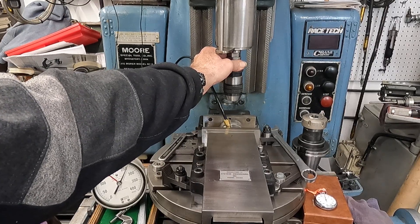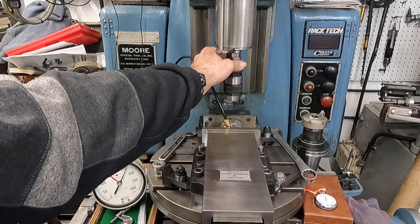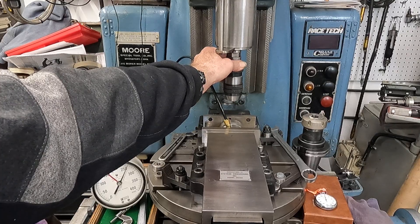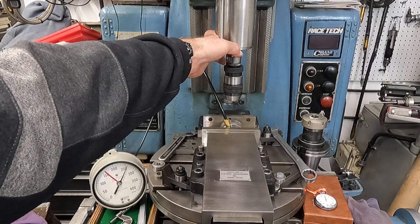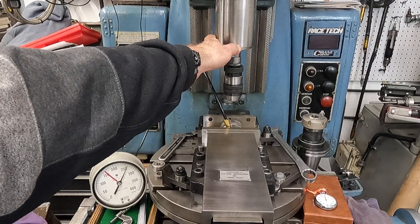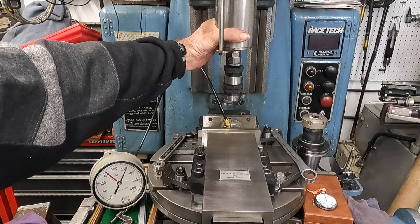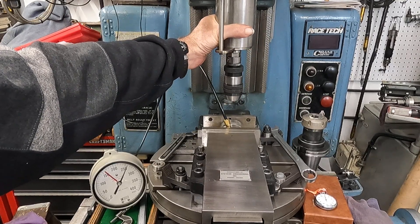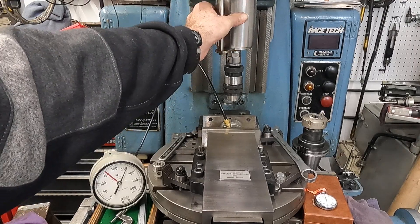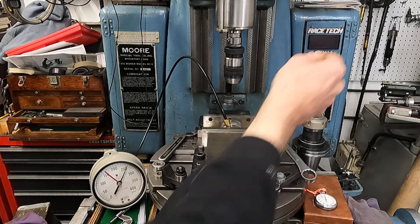Be aware that the shelf life of special grease is five years, so if you get 20 years out of a set of bearings like this, you're doing good. To test this machine, run it for at least 10 minutes at full speed and see how hot it gets. The quill is such a tight fit that if it gets very warm, you won't be able to retract the spindle — it'll stick right there.